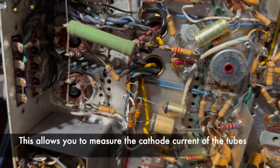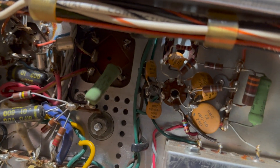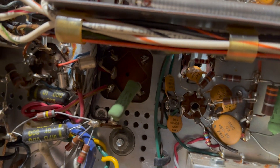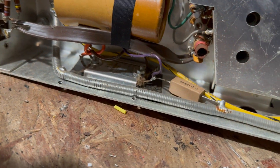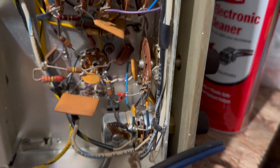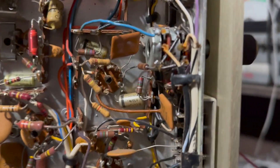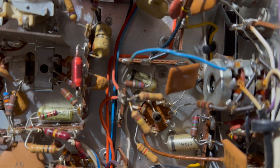These need to be replaced with resistors — those little ties to ground. You've got some other can caps that need to be replaced. A couple there. That one's going to be a pain. This big bias capacitor needs to be changed, and this selenium needs to be replaced. We've got a bunch of controls that need to be cleaned — that's easy. Some of these capacitors: some are okay, some will need to be replaced.